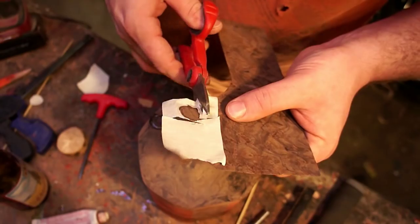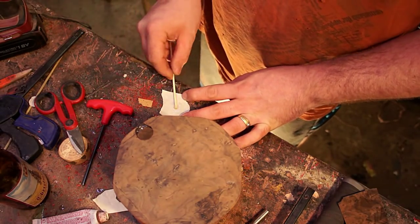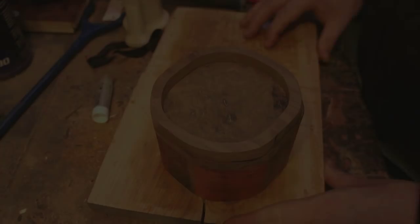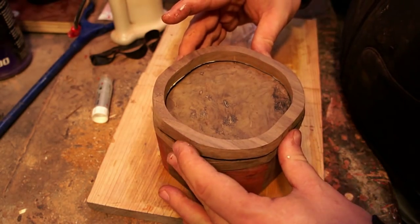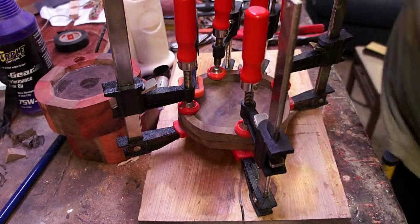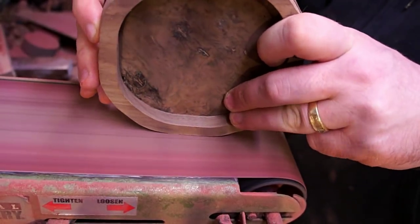After the two-part epoxy had cured, I went back and sanded everything down to make sure it was flush enough for the trim piece to fit around there. While applying the glue I was trying to squeeze it out toward the outer edge of the ring to minimize squeeze-out on the inside, which would be almost impossible to sand around that inside edge. Put on a bunch of clamps, let her dry, and now we have it all in one piece. After the clamps are off, we're going to take it over to the belt sander — I tried to cut the pieces as close as possible, but there's inevitably going to be a little bit of lift, so belt sanding smooths it all off.